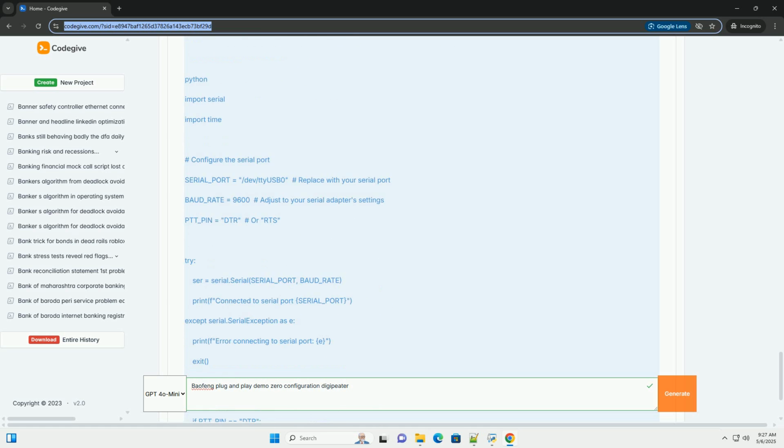If you only have one sound card, you'll need to use it for both receive and transmit, which can be tricky. plughw:2,0 is an example for USB audio card 2. PTT: if you can use the serial port for PTT, this will be a great advantage. Otherwise, you can use VOX, but will probably need a separate sound card for transmit. MODEM sets the modem type to 1200 baud AFSK, which is the standard for APRS. KISSPORT enables the KISS TCP port, which allows other programs to connect to Direwolf for APRS data.